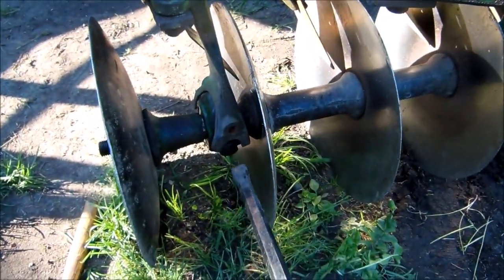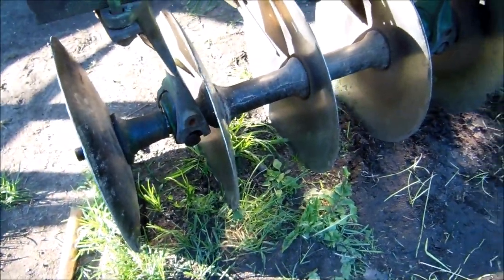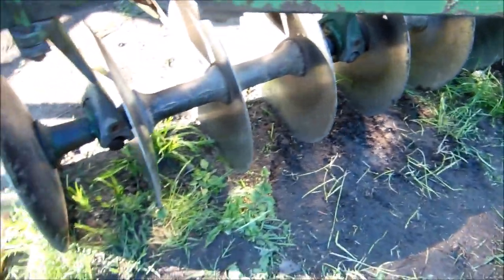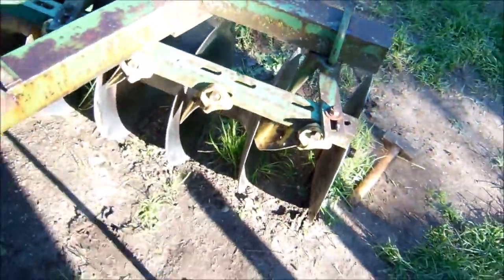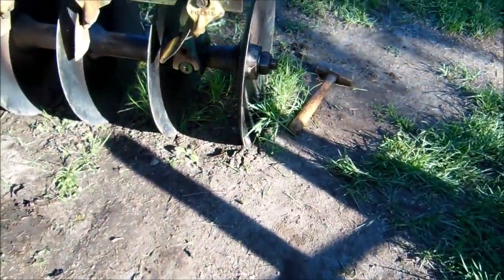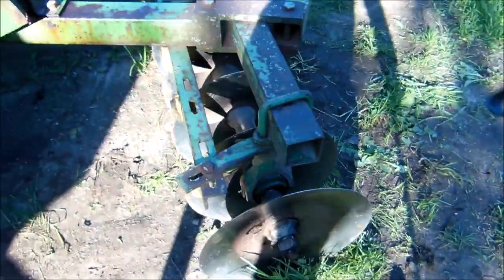I told him he should just sell it and get rid of it. Then next time he'll just hook up the tractor with the hydraulics and lift it and do it the way he should have instead of depending on that jack, because they're seriously not safe. So we've got it lowered down, and we're lining up everything here with the pins that go in, and that is just the final assembly piece. It's a little bit fussy trying to line up the front hole with the back hole, so he's having to have me help him line up everything with the pry bar as we're going.